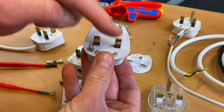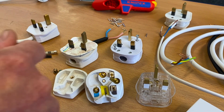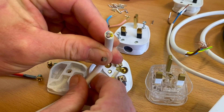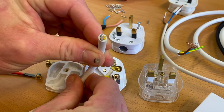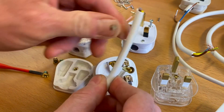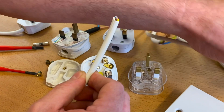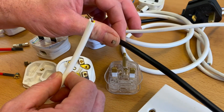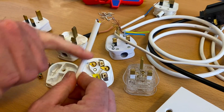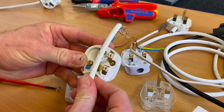You must remove the cardboard before closing the plug as it could get hot between the pins and catch fire. I've got three-core flex. We talked in a previous video about two-core flex without the earth, used for double-insulated items - we showed the double-insulated symbol. I'm going to remove the outer PVC, which can be white or black. We're going to put a white flexible cable into our plug top.